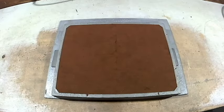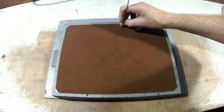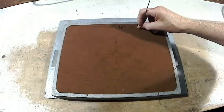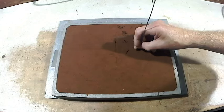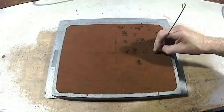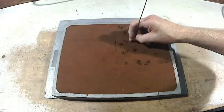The drag half of the mold has been rammed up. What I intend to do is on the left-hand side I will vent, and on the right-hand side I won't vent, and we'll see if there's any difference when I knock out the mold. The funny thing is I see on YouTube everyone vents the cope but never the drag.